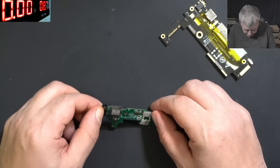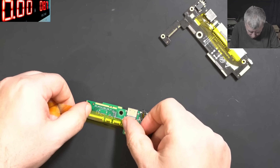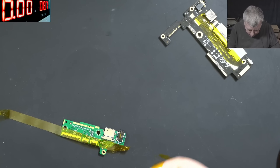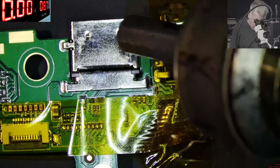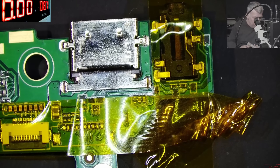When the tape moves it can take your connectors with it — it happened to me, so I know what I'm talking about. So let's isolate from this side and place the tape in such a way that it won't have any pressure to slide or move the connectors. Now we have the jack covered. I need a bigger nozzle. We'll go with 350 degrees — 350 actually — because this is a small board and doesn't need that much heat.